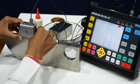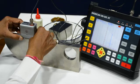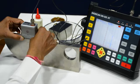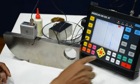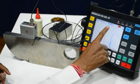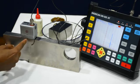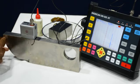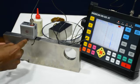Now this is the location — the echo is decreasing, now increasing, decreasing here. This is the point at this location where the height of this echo is maximum. Now we have to see the beam path. This is the beam path — here it is the radius. So from this center the radius will always be constant because this is the arc of this center.